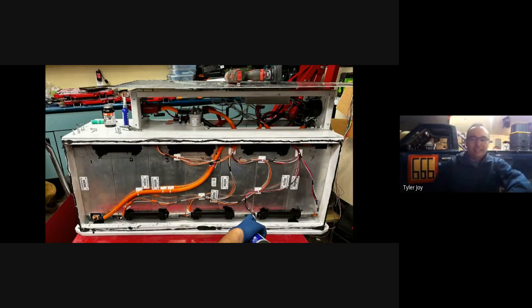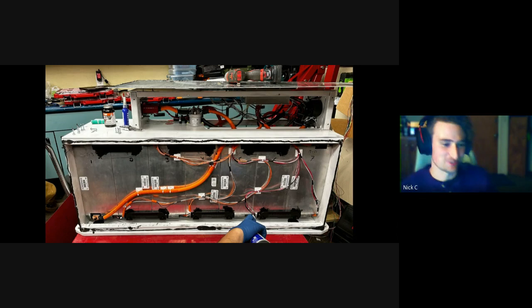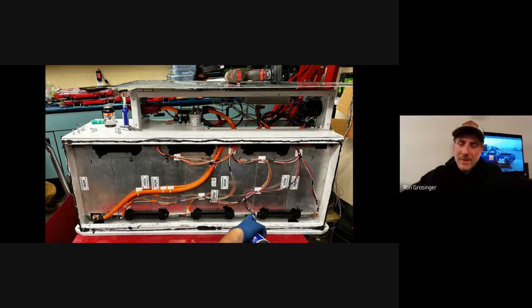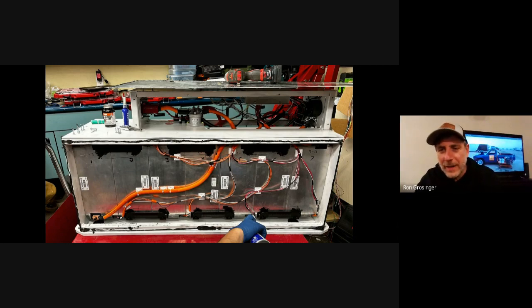So when is your... go ahead. Sorry, Nick. I think the battery swapping and charging is really the biggest problem with endurance racing and EV, right? And from our point of view, that's still the biggest problem we have to solve. Like Tyler said, we're going to be stopping slightly more frequently than an ICE car, so our battery swap has to be faster than a fuel fill up. And when you're racing, fuel fill ups aren't from a pump, they're from jerry cans over the pit wall. But still, somehow we have to be competitive with that, a couple minutes time frame with a full battery swap. So you're not just creating the truck that's got to do the race, but you also have to create your own infrastructure situation for charging.